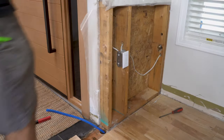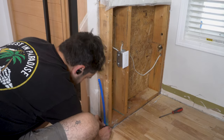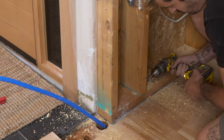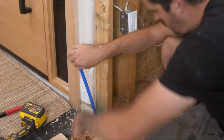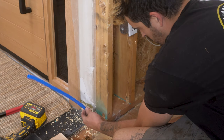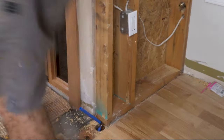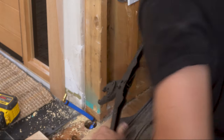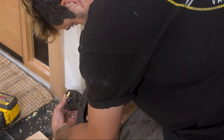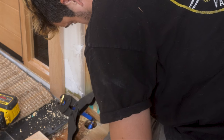I connected to the plumbing located in the crawl space and then brought it up through a new hole which sits closer to the existing wall. I then marked and drilled a hole big enough for the plumbing to go through to the studs and to the faucet. I cut the PEX pipe coming up from the floor to the height of the hole. Then using my PEX clamp I clamped a 90 degree elbow to the end of the PEX pipe using a 90 degree elbow and a PEX ring. All these parts will be listed in the description down below.